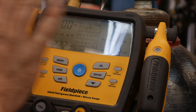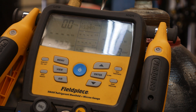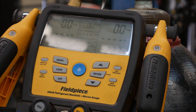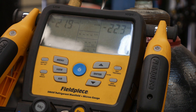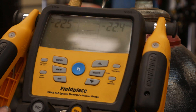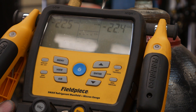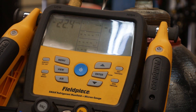Valves are closed, we're at zero psi, and I've pulled the system into a vacuum. Once I connect the hoses we should see vacuum show up. I could have hooked a hose from the manifold set to continue pulling vacuum and evacuate the manifold gauge set, but I'm not too concerned about it. I had both manifold ports open, so both sides went down to 22 inches of vacuum. I lost a little vacuum evacuating the gauges, but that's fine.